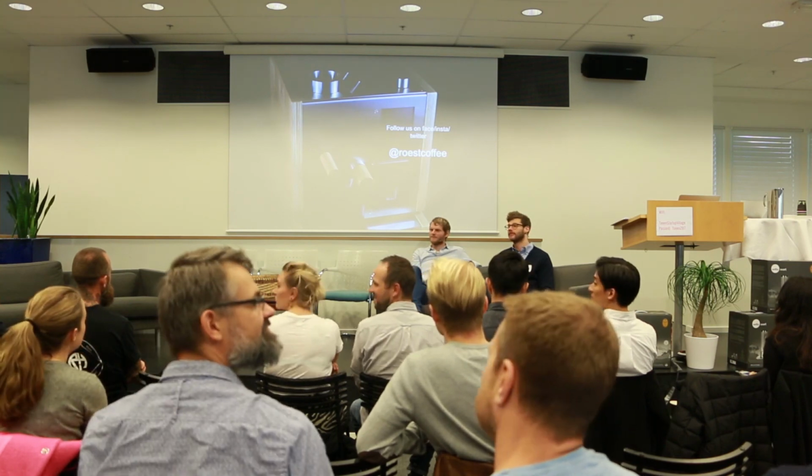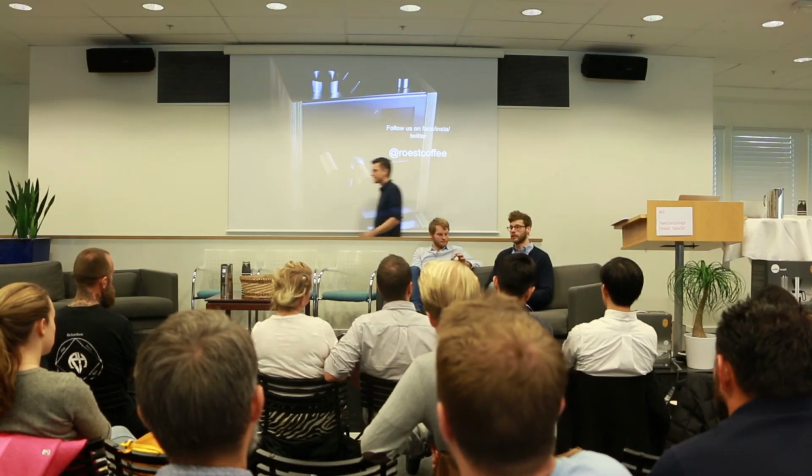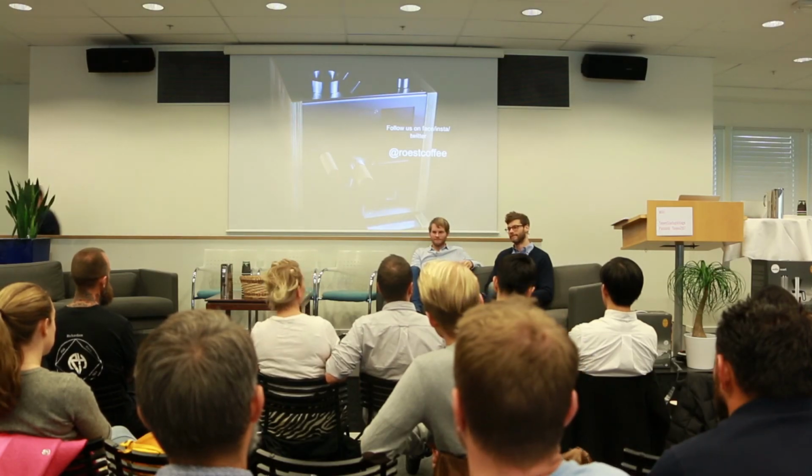So do you have flexibility in batch size? We can roast as low as you want. The biggest problem then is that you have to learn how to roast on it. Because if you put 50 grams in it, the bean temperature is placed in such a way that it's ideal for 100 grams. But if you do environmental roast based on the environmental roasting temperature, you can just define a profile and you can have a very good roast even on 50 grams. Funny thing about that is that you can roast coffee in less than 2 minutes.